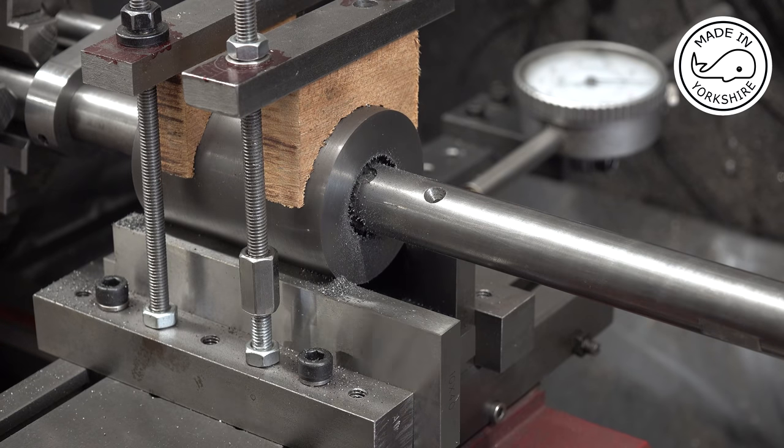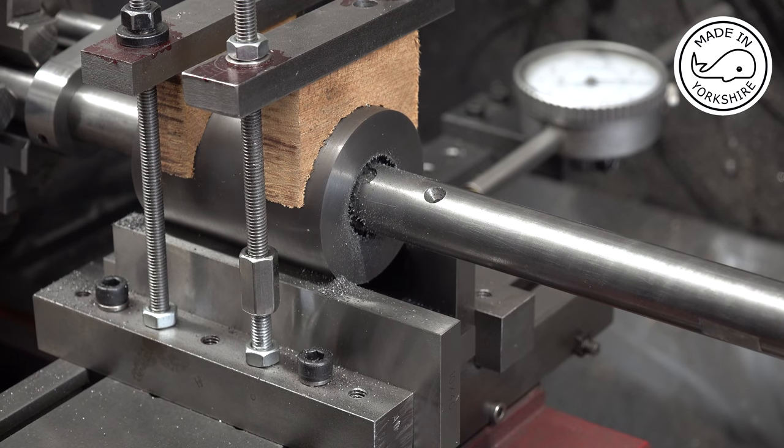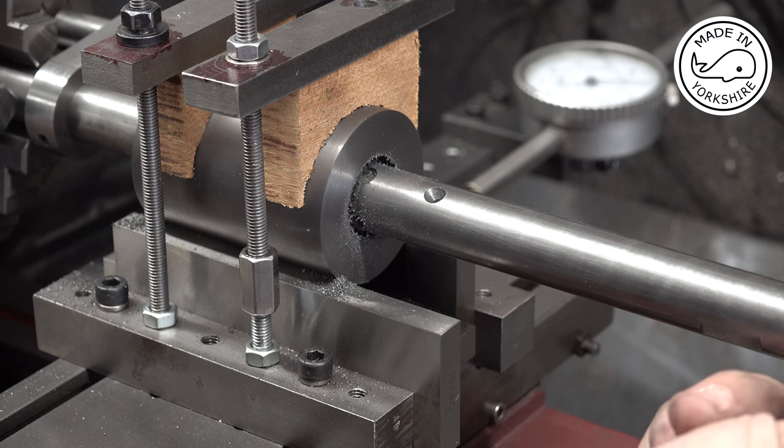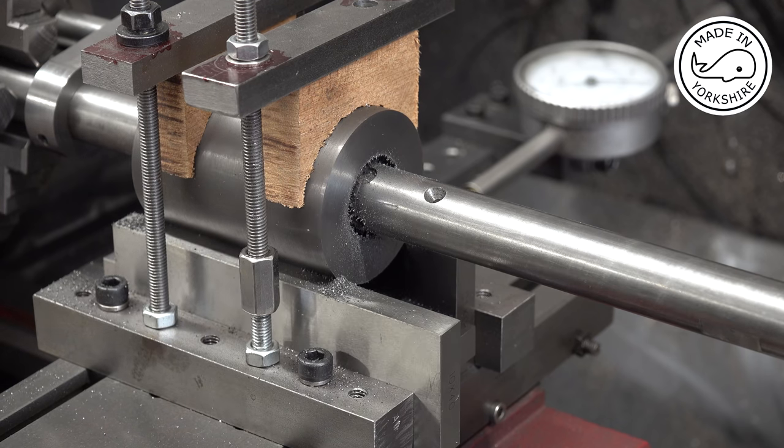I've noticed there's a bit of vibration. Last time I tried this on the farm boy my first attempt I got a vibration and that was a dodgy live centre, so I'll have to keep my eye on that. Anyway I'll measure the internal bore again and keep repeating it until I get to the 1.003 I'm aiming at.